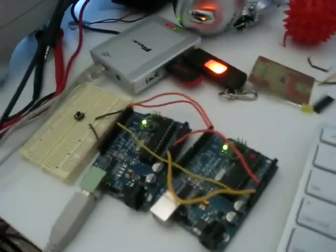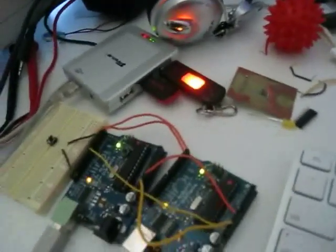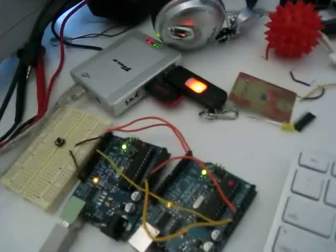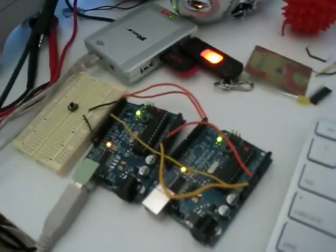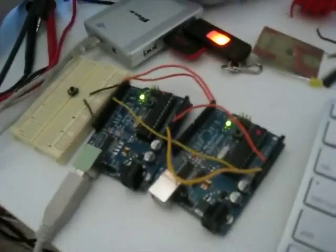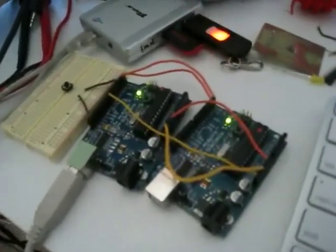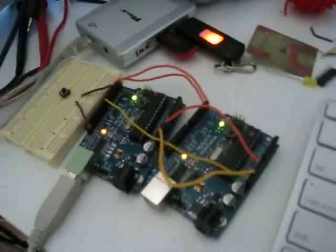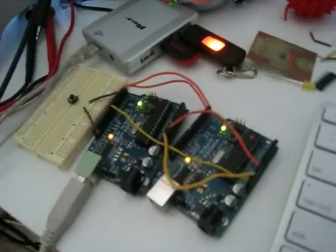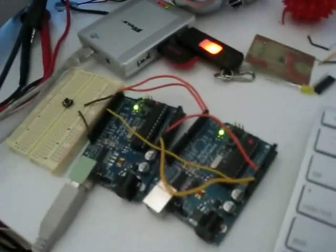It's not exactly self-replication because I'm not sure of any way that you can read, within the Arduino sketch, the actual hex file that is stored on the ATmega328 chip. The programmer that I've implemented is pretty rough because it will only work on ATmega328s. It doesn't do any code verification, and in some cases it seems to write more bytes to the other chip's flash than it should.